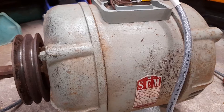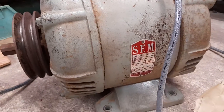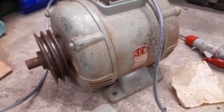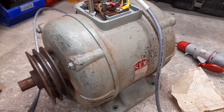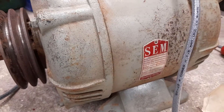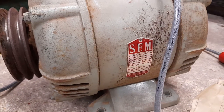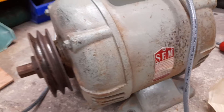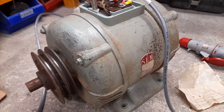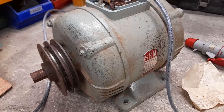It might not run at the rated power output. I'm assuming because we've approximately half the voltage, it would be about a quarter of the power. Also, I think it's going to run at the same frequency you would expect at the higher voltage because it's an induction motor, so the rotational speed will be frequency dependent rather than voltage dependent.